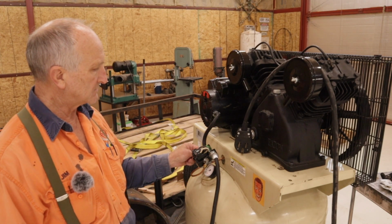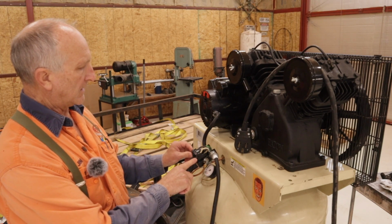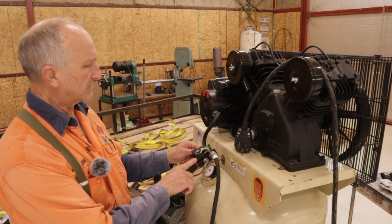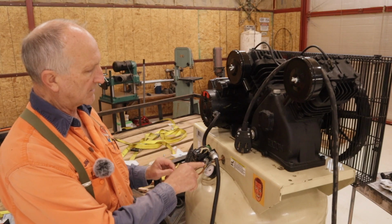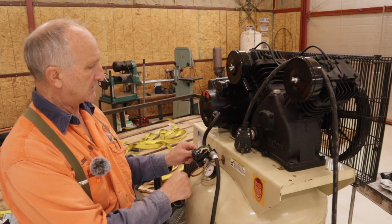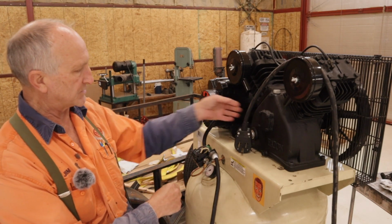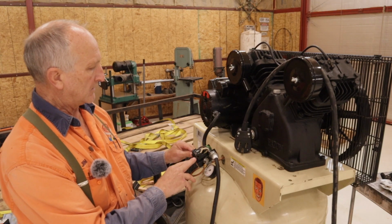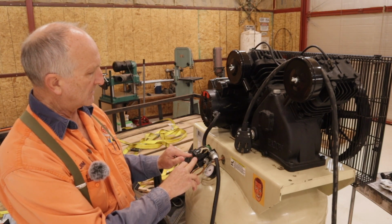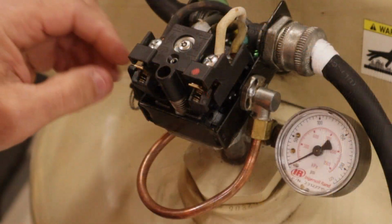This switch here, or the other one, welded the contact, and this one gives up actually a little bit. This worked a couple of times, and I noticed that this pressure relief wasn't relieving. When it shut off, there was no hissing coming on here, and that's venting the high pressure from the header pipe there. So that meant this one was welded. This one actually has a bit of flex. You can see it moving, or I can anyways. Let me show you. This is properly operating now.